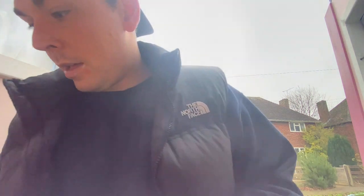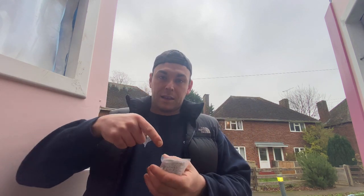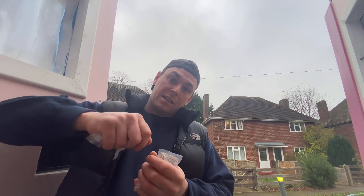One flimsy little nail in a decking holder is not going to be rigid, especially going into metal. If it was going into wood, then yeah, maybe. And if it's not on a motorway every single day, then yeah, maybe. But this has got wind, this has got battering by the elements, so we decided to bolt that down. So what I use for that is just a 30mm M6 bolt that goes through the back, through the decking, and then gives you enough space to go into the groove and into this inset bolt on the aluminium.